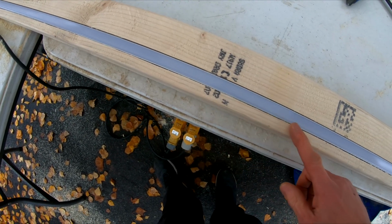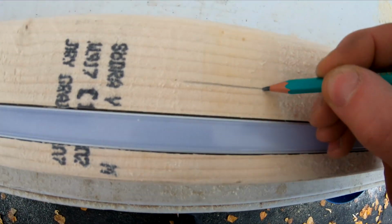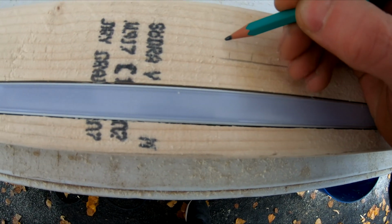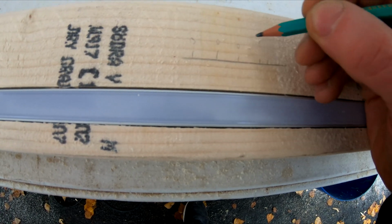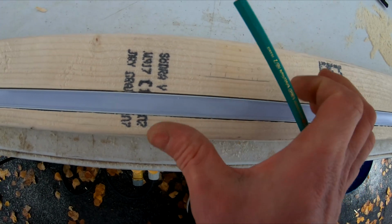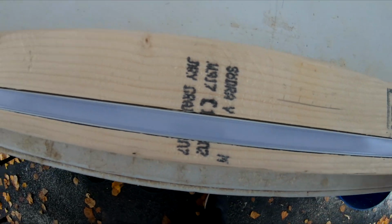So what I mean by that is, if you put an LED strip onto a wall or ceiling or anything like that, where the strip comes along like this, there's small LEDs in the strip, and what that'll actually do is, because it's going to be quite close to the ceiling, you will actually see these individual spots of light like that onto the ceiling. So by using this diffuser strip, it actually eliminates that, because it just gives you a broader light, so you don't get these pinpoint points of light basically on the ceiling.